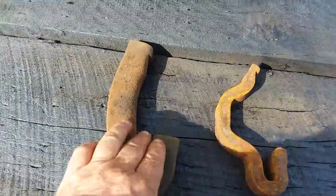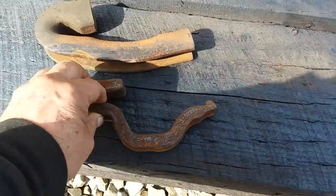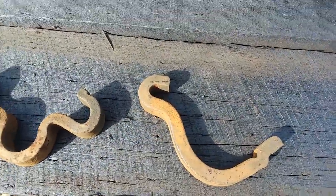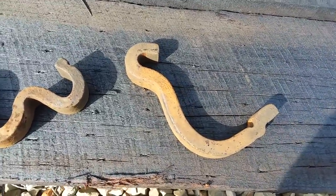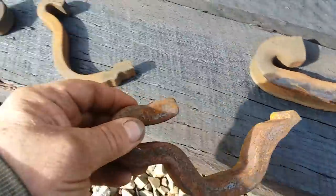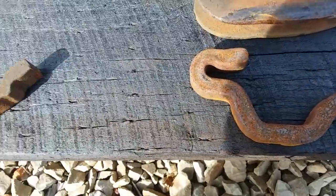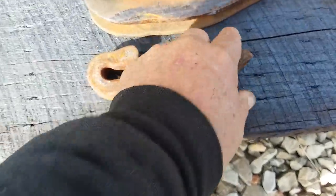There are two different actual types of rail anchors. These are called drive-ons. The second type is called a spring type. Some people call them wrench-ons, and we've always called them, for slang, snap-on anchors. This one right here is called a unit drive-on — you drive it on with a hammer. The rail goes in here and then this comes up under the base of the rail.